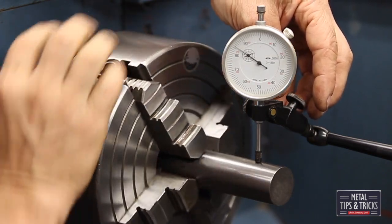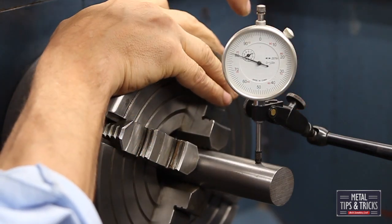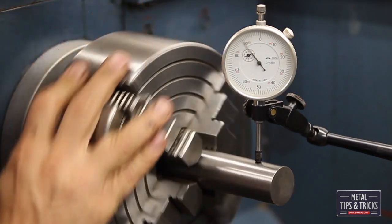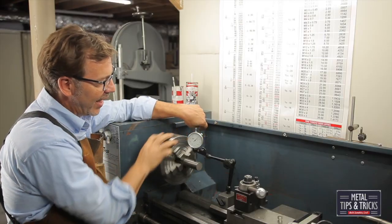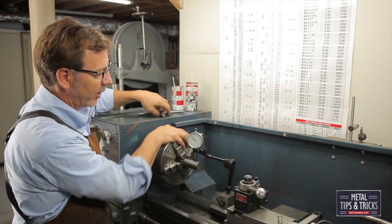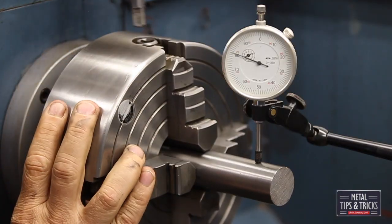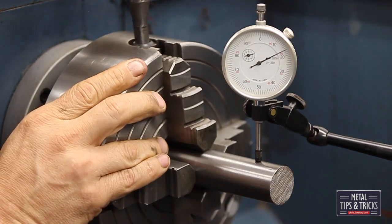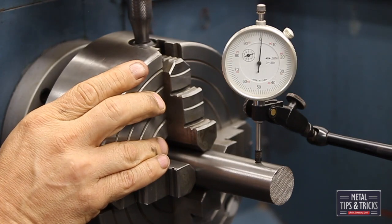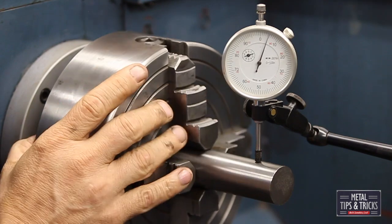You can see what I'm trying to do — I'm splitting the difference. Here's my low at 80, which is about 10 to 20 thousandths off, and there's my high at 20 thousandths off from zero. Now I have a really great zero to work from. I'm going to go to my low and loosen just a bit, then go to my high and tighten it up — see how I brought that into zero.